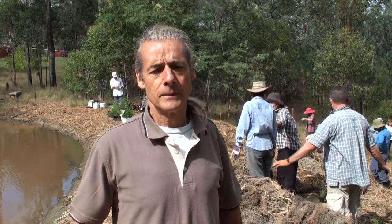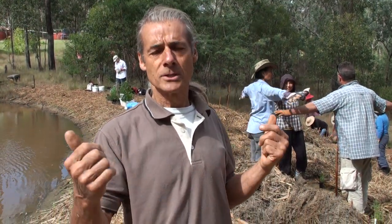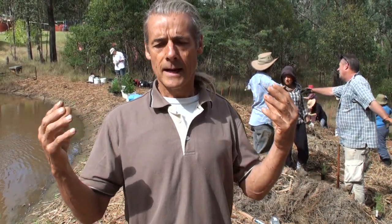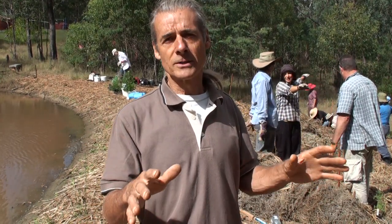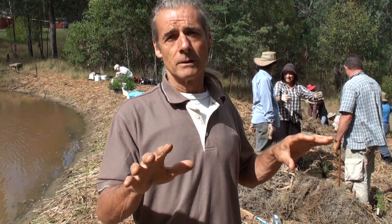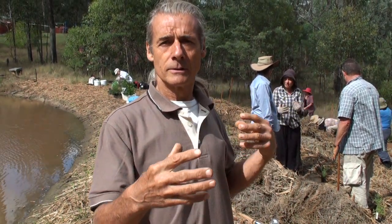So we've hopefully repaired that with a leaky swale. But what we're doing from the top, we create swales to catch the rainwater, to slow it down. And we're doing it in a fishtail pattern, so that as one fills up, it filters into the next one, and it just slows the whole process of the water, so it's almost to a trickle. Therefore, you don't get the erosion that accompanies a normal storm.